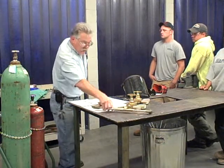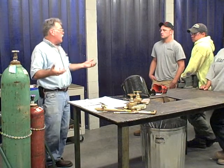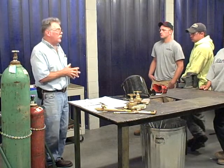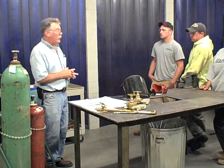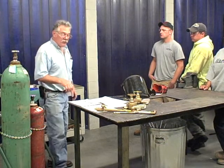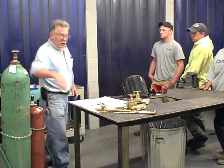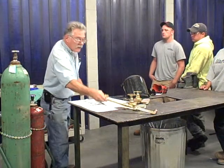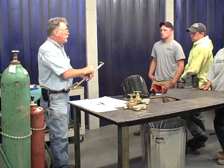So that was the proper setup. You've got everything set up. You'll do your projects, cut it down. End of the day, we're going to shut the torch down. So let's go over the proper shutdown sequence, which is oxygen first, on the torch. I'm going to shut it off here. Then acetylene.